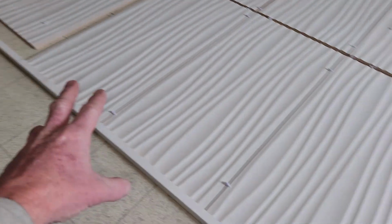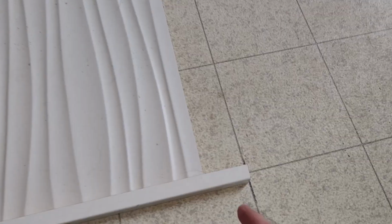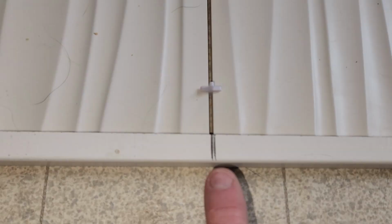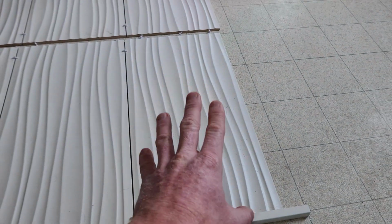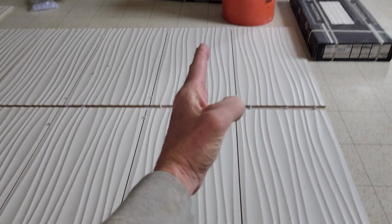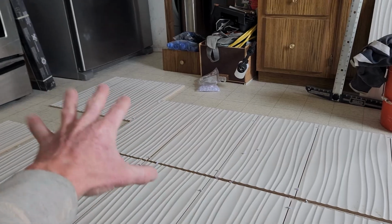But as you can see here, now I know where my full tiles need to go. So again, this is going to be the bottom. Now with the way this tile is laid out, again, this is my grout line. So I'm going to have behind the freestanding tub, you're not even going to see it, a very thin strip down at the very bottom. It's just kind of how it worked out. I know that this right here is my grout line for the very bottom. So again, I'm not gonna do these ones until after the floor, as with the small strip. I'm gonna start with this one right here. So we're gonna go 4 up on each side with our cuts and then work our window up there.